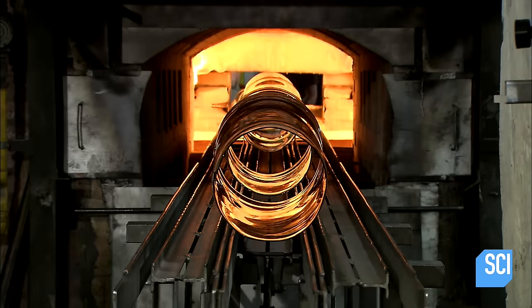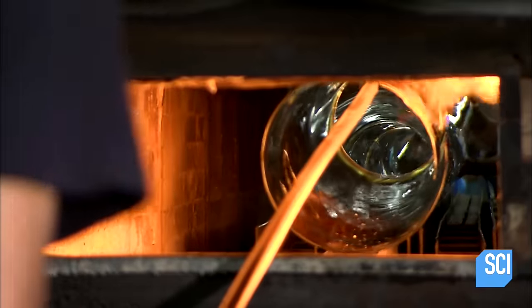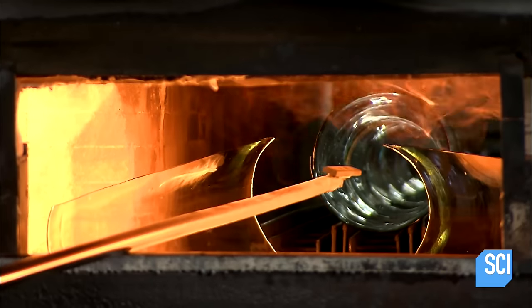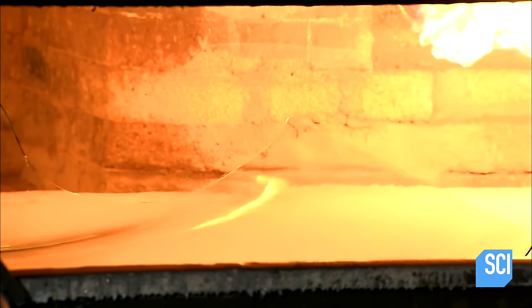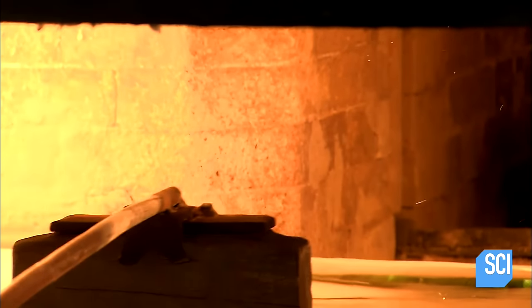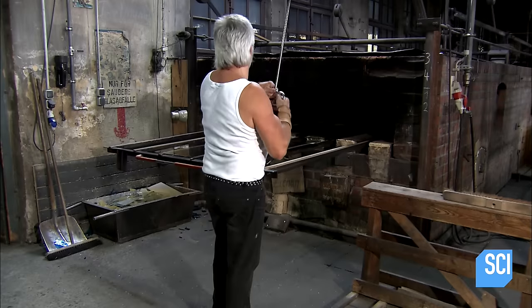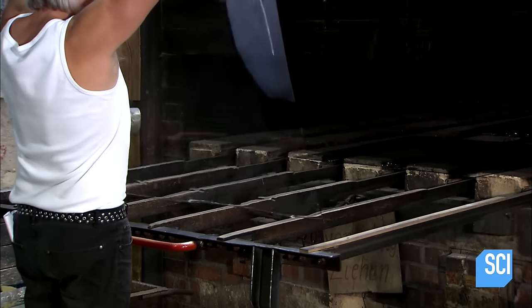The flattening team's job is to transform the cylinder into sheet glass. The flattening master's assistant puts the cylinder into a furnace, heated to over 1,500 degrees. The glass softens in about 30 minutes. Then the flattening master reaches into the opposite end of the furnace with a stick and gently opens the cylinder. Next, he irons the glass sheet flat with a special wooden tool. The flat sheet goes into the annealing oven for a gradual, controlled cool-down, which relieves stress and prevents cracking. The assistant then removes the glass and performs a visual inspection.